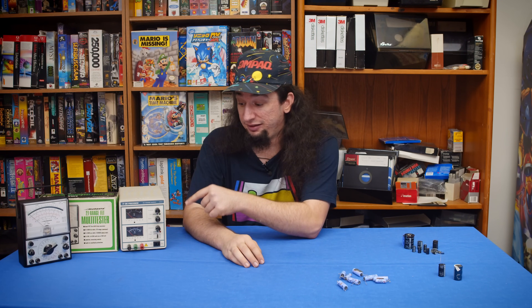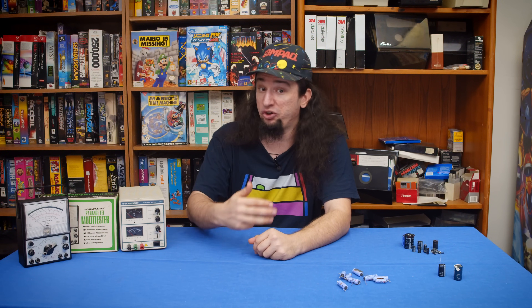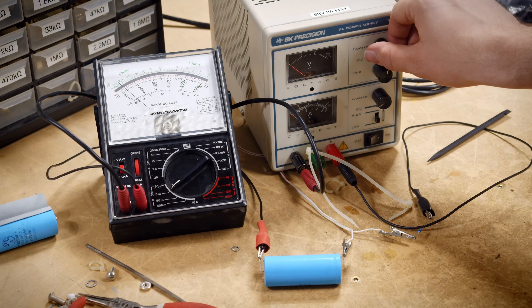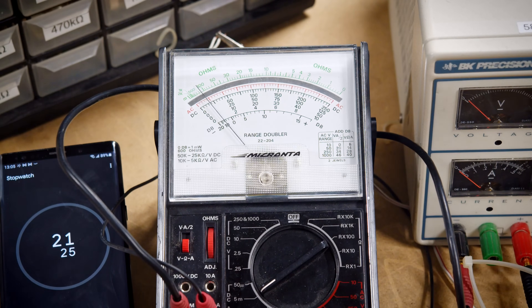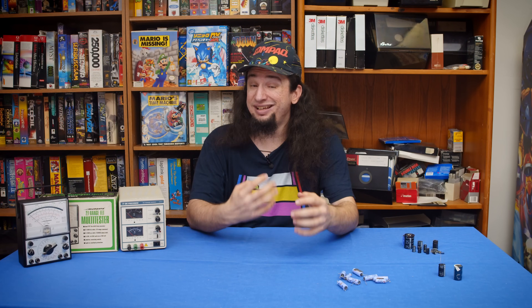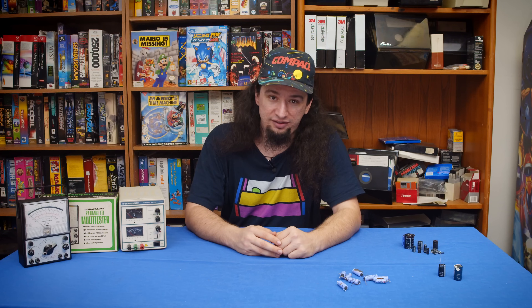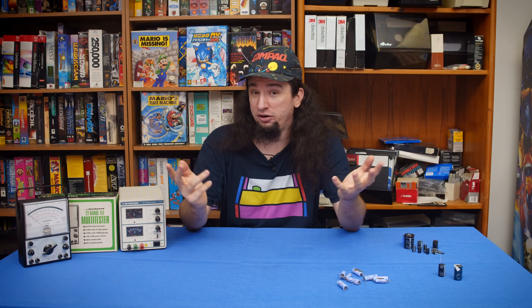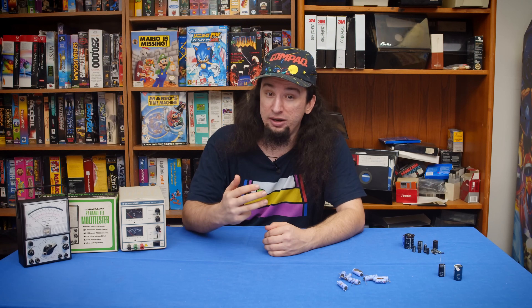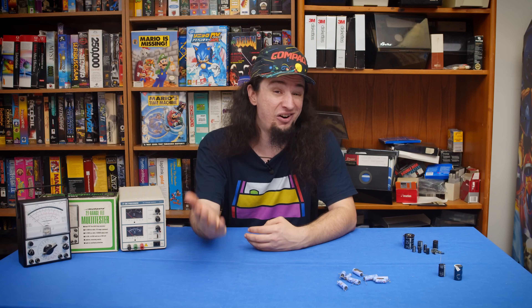With everything connected, you can start. If you have an analog power supply, make sure you set it to zero volts before turning it on. Turn on the power supply and slowly raise the voltage until you see it peak at the limit you decided on. You'll see that it will quickly reduce down, but the speed of that also ramps down. Even when it seems like it's stopped, it is actually still reducing, just very slowly. This is the current breaking down the electrolyte to rebuild the oxide layer. There will always be some current draw here because capacitors have a leakage current, so you will need to pick a current minimum above that where you feel safe it has been reformed up to that point.